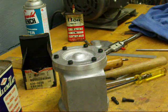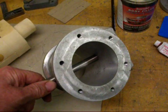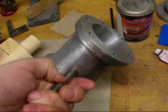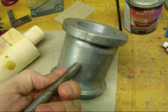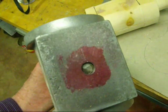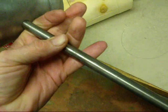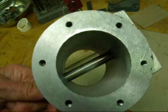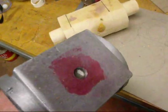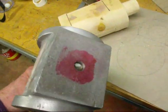I drilled and tapped the holes on the other end, so both ends are done. And now I've drilled the hole clear through and reamed it at half inch, and that's right on center. I took a half inch drill rod and it's fastened in there with Loctite, so I can easily get it out simply by heating it with a propane torch — it doesn't have to get real hot. Now I'm going to put it in the three jaw chuck.